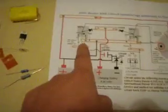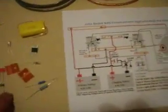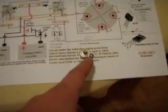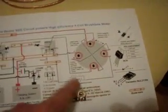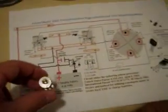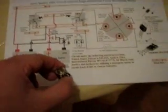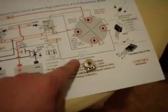So you have your resistors here and here. You connect them to the base of the transistors. You can swap them around, or swap them for a variable resistor or potentiometer. These go by different names and are drawn on schematics different ways, but this one's actually provided for this part of the circuit. You can get your own at these values or above and tune them yourself if you prefer. I recommend just using the ones Rick has provided to get familiar with the kit, and then start experimenting with potentiometers if you really want to. For now, this 1K or 1000 ohm potentiometer belongs in this part here, so that's this guy right there.